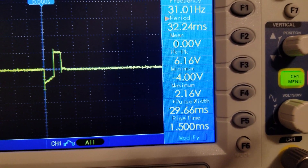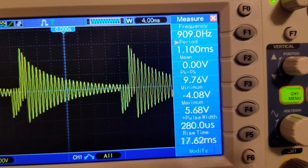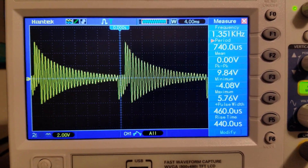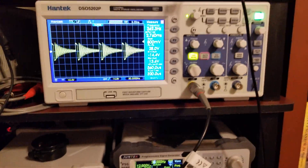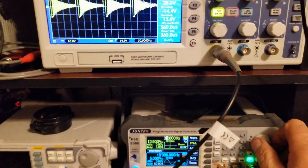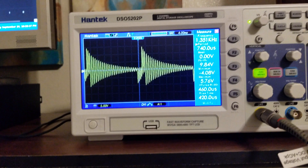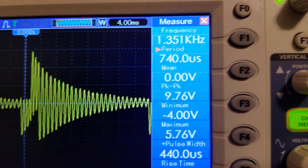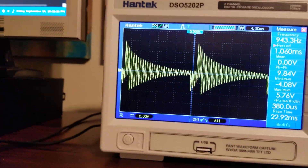This is our volts at 31 Hertz — 9.84, 9.5, whatever you want to call it. Resonance. This 31 Hertz with a 10 microfarad cap with this much winding. I don't know why that's reading 1.3 kilohertz — it's got to be harmonic, tricking the scope.